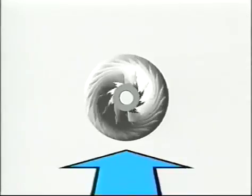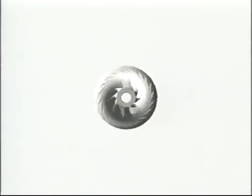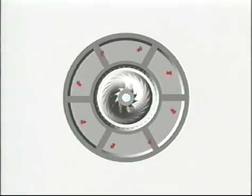As the impeller rotates, it moves the refrigerant vapor from its suction opening in the center to its outer edge by centrifugal force. The vapor enters the suction at a relatively low velocity and leaves the outer edge of the impeller at a high velocity. In other words, the impeller transfers its rotational energy to the vapor. However, high velocity is not high pressure. In order to get a pressure increase, or compression, the vapor must be slowed down to convert its velocity pressure to static pressure. This is accomplished in the diffuser.